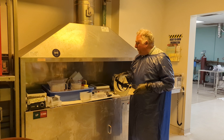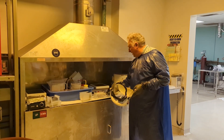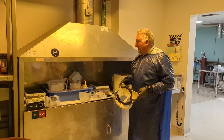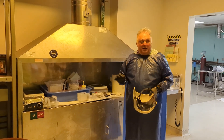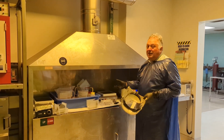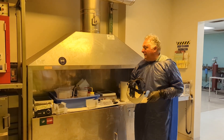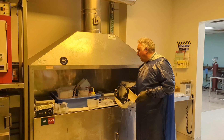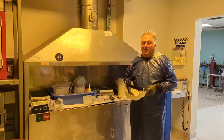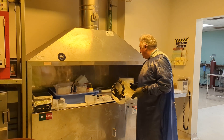We have post-baked our wafers, and they're now ready for etch. It's a five-minute process, so as soon as I stick it in, press pause. Because as opposed to the blank wafer where you see sheeting when the HF is done, that won't happen here — it'll stick to the photoresist. So you really just have to go for your five minutes and then verify what happened. That is a long etch, and probably not post-baking would not work. With the other one it was only in there a minute; this one will be in there for five.